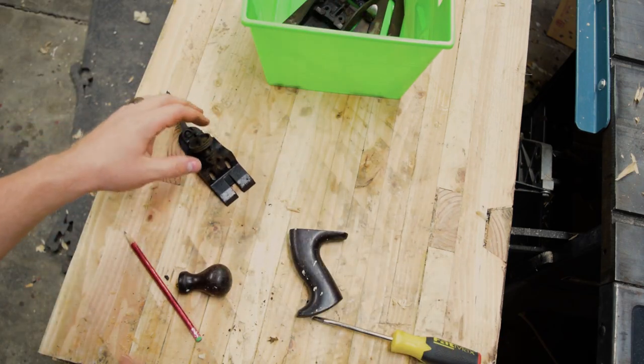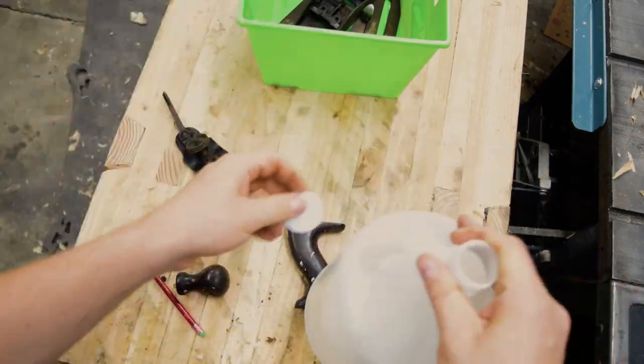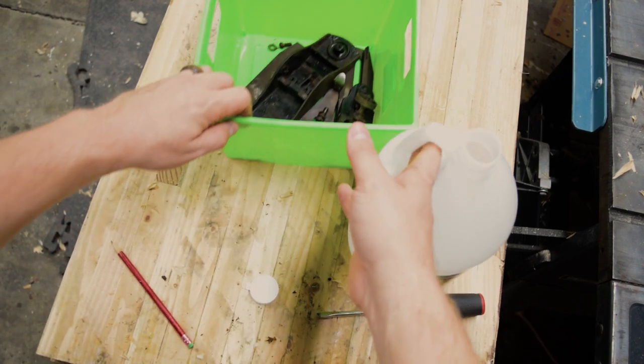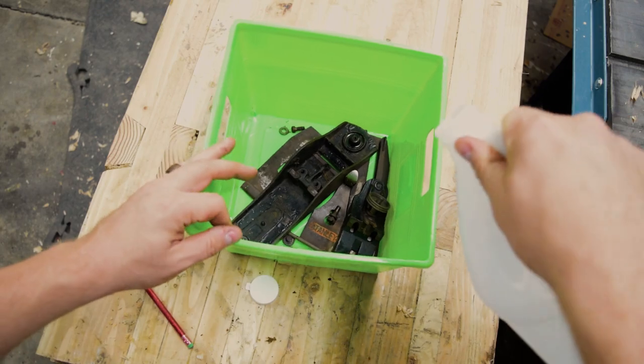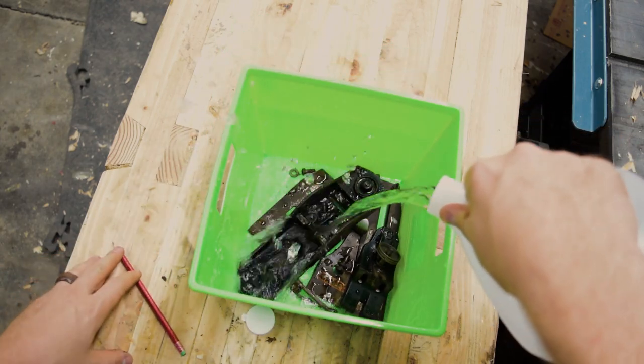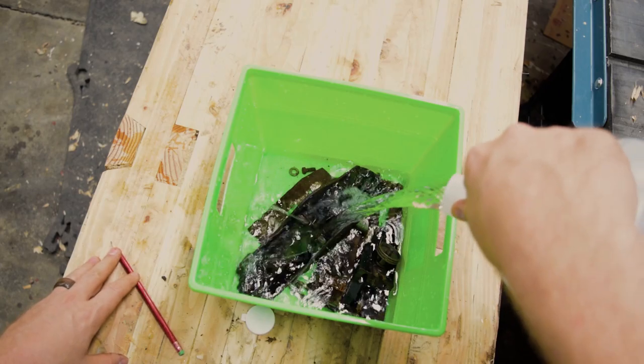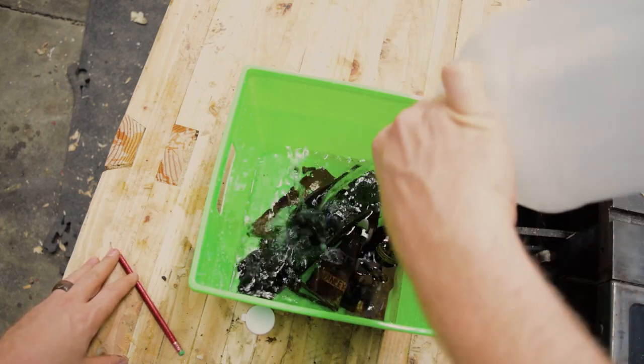The sole's in pretty good shape — not sure how flat, but looked to be all right. I'm using five percent food grade vinegar. Just pour it in there, let it soak overnight, and then hit it with burlap pads, sandpaper, and what have you tomorrow.